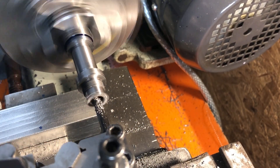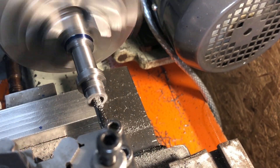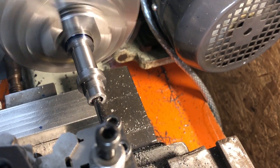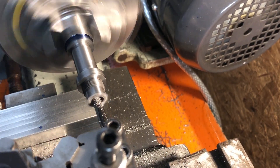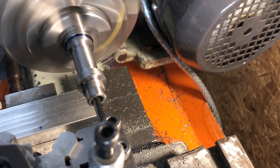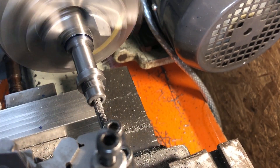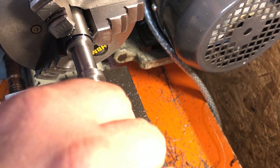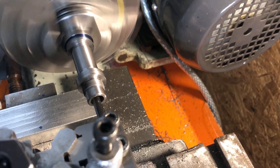I don't have any small hole gauges, so as we progress I'm testing the bore with a drill bit that's measured to be 10 thou smaller than my silver steel. As I'm putting 5 thou of cut on each pass, as long as this test piece doesn't fit, I can take another 10 thou off diameter without worrying I'll ever shoot my dimension. Once it does fit, I can judge the quality of that fit and begin to creep up to my final size.